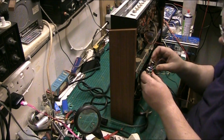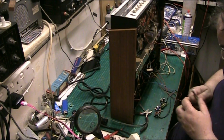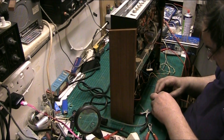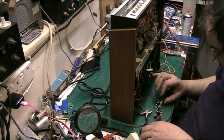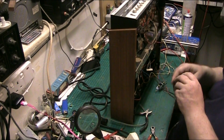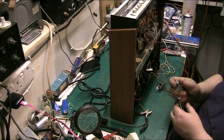These are basically two mono amplifiers. Just so I know what I'm up to, because I wired these but they're obviously going to be rewired anyway — two separate ones. This is power to both sides of them, so we'll snip that there, we'll snip that one there, because we'll probably put new wires in anyway. This is the input, which we're not really too concerned about — that'll need to be redone. So we'll just snip that off there and we'll end up with clean wires.